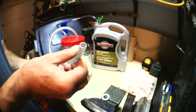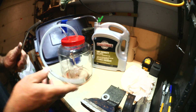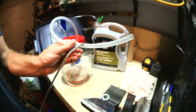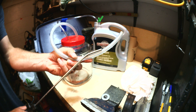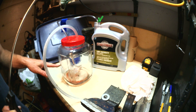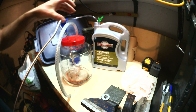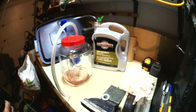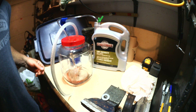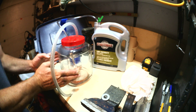This outer tube is bigger — you need some room around the air nozzle for the air to come out. If you used the same diameter, it would block the air from coming out and it's not going to work. Just drill a hole, and if you want to pump you push the air out. As I showed you, you can also do the opposite: push fluid out of the jar by reversing the process and pushing air pressure in. The jar cost me about 8 bucks, tubing maybe 10 bucks — so it's less than 20 bucks for a vacuum pump. Pretty cheap!